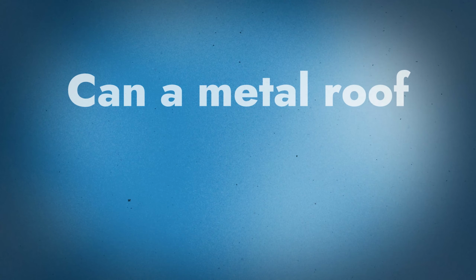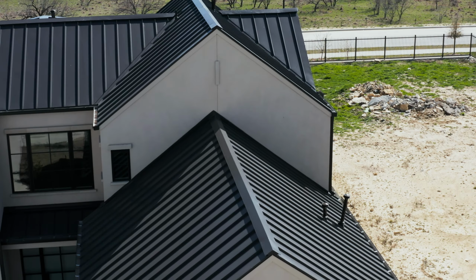So, if a roof is nearing the end of its service life, but it's not quite there, and someone gets a renewal done, is that going to extend its life further, or is that still just going to be the end of its service life at the original time? It's a good question. It again goes back to what coating system is selected and the level of technical surface preparation that's done. You can install a coating system on a roof and make it last 3 more years. You can install a coating system on a roof and make it last 10, 20 more years, even if the roof itself is at the end of its service life, because the new protective coating system is going to protect that substrate from corrosion and rust and all the elements of weather that it originally was intended to do.